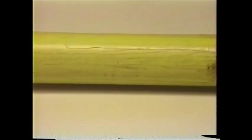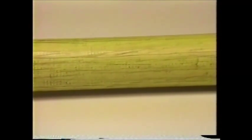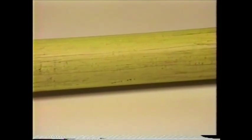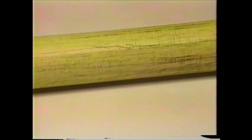It can be highly conductive particles separated by good dielectric fiberglass, resulting in a higher capacitive current over the surface of the stick. The contamination can also take the form of a more uniform, highly resistive coating, which will result in a resistive current flowing across the stick. It may even be possible to have a somewhat inductive contamination on the fiberglass. In any event, whether the contamination causes a capacitive current, an inductive current, or a resistive current, it will be linear with the voltage applied.